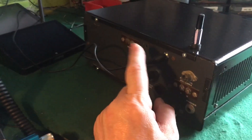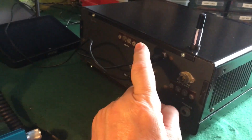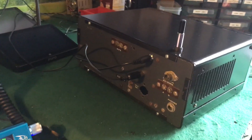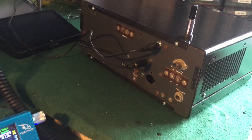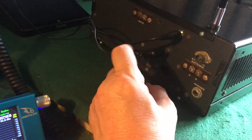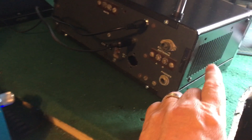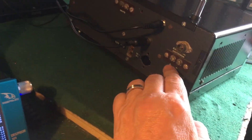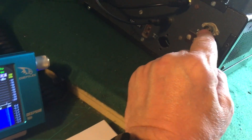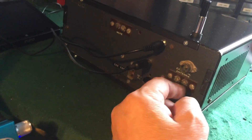I've got 9.79 volts going into it from my power supply. It used to run on about 9.6 volts with the internal NiCad battery pack, but that's no more. I took out the charging stuff and the transformer because they weren't being used, so it's now just powered from a 10-volt DC socket. It's got a headphone socket which works and cuts the speaker out, and the original aerial and ground terminals are still connected.